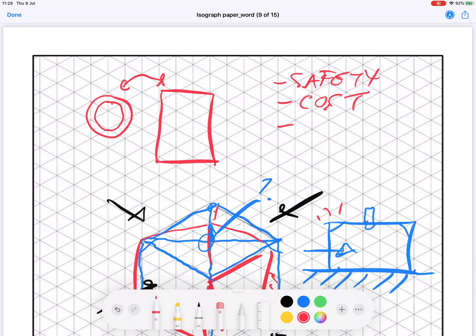But to assess that your design is comparable to that of a bought gazebo, you might want to do some basic calculations on the second moment of area, look at the stress going through the tubular steel frame and the timber, and get a sense that your design is almost comparable with that. Of course, your timber will be heavier, bigger, because it's not going to be as strong or as stiff as tubular steel.